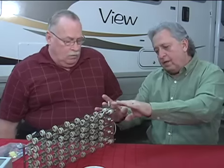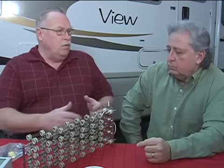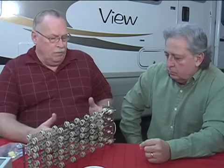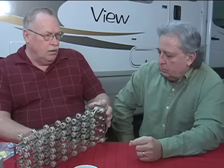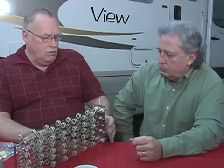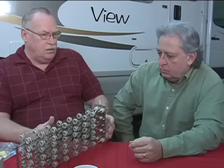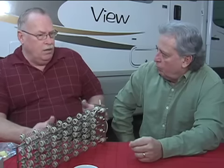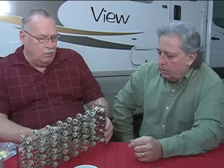Another advantage is we have three different heat levels — you can see the three different wattage ratings on the end. Different-sized RVs require different amounts of heat, and some have a 50-amp circuit while others have a 30-amp circuit. The uniqueness of this coil is that, depending on which you select, it will run on 115 volts at 30 amps or 250 volts on 50 amps. We tried to design one system to cover the RV industry from 20-footers all the way up to 40-footers.